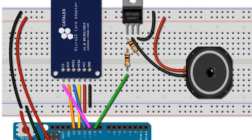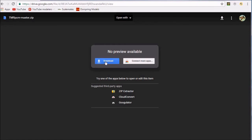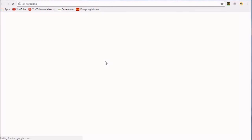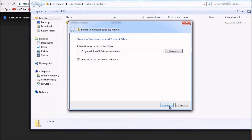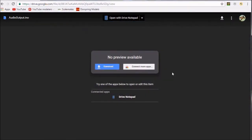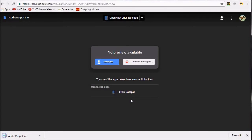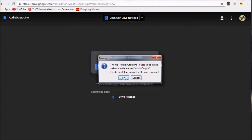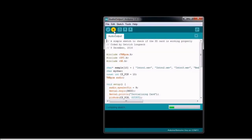That's the circuit done. In our next step we need to install the SD card library by downloading the zip file from the link below. Once downloaded, we navigate to the program files directory in which we installed our Arduino user interface, click on the library sub-directory, and extract the zip file into this directory. Once done, we download the audio output sketch from the link below and save it in our Arduino working directory, usually in the documents folder. We click this file to run it, move it to its own directory if prompted, connect our Arduino Uno to our consoles, and upload the sketch.